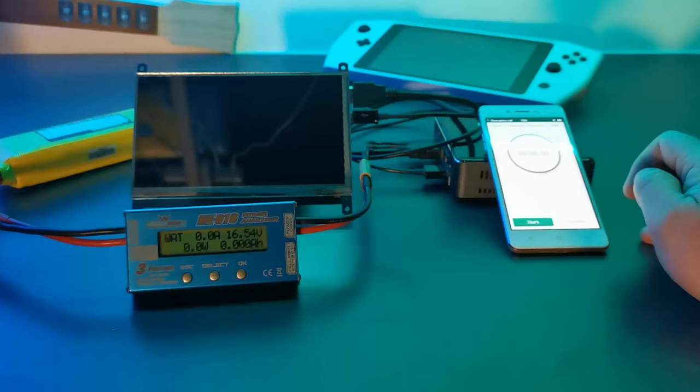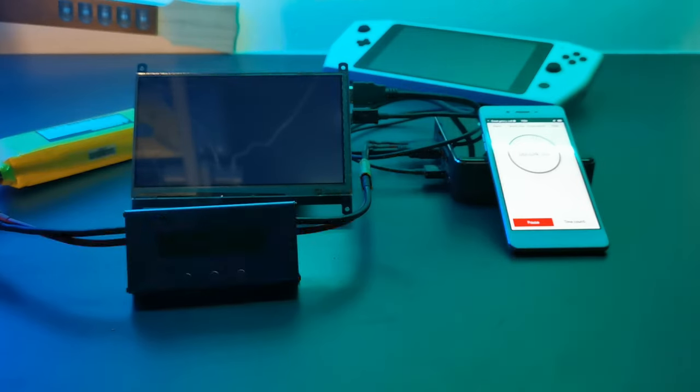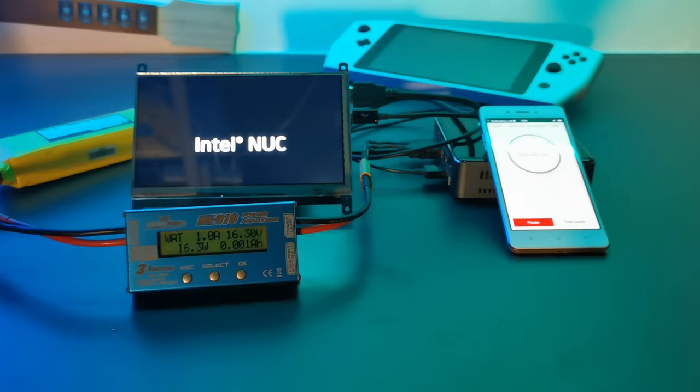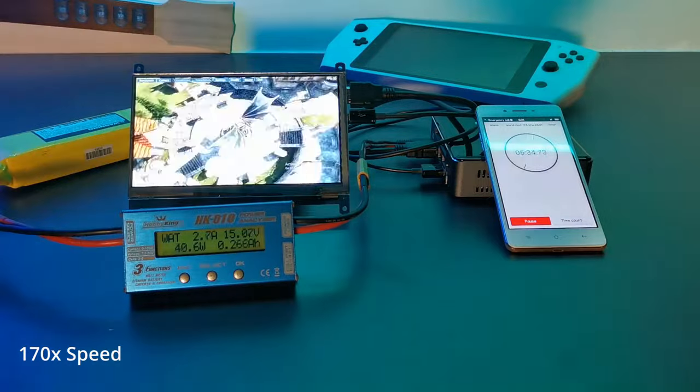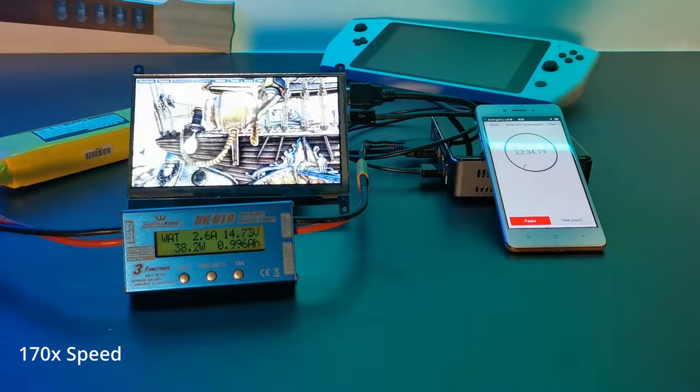For power, I am planning to use four 3000mAh lithium cells in a series configuration, which will power the NUC for about an hour at full load. The Intel spec claims the NUC will run on anywhere from 12 to 19 volts, making a 4S lithium battery an ideal candidate to power it directly without any voltage regulation. I've done a battery run-down test and can confirm the NUC happily runs all the way down to 12 volts and even slightly below without any issues, getting just over an hour under heavy load. This test also included powering the display from the NUC's USB port, so it covers the two most power-demanding parts of the device.